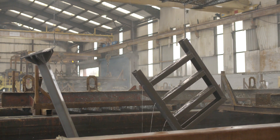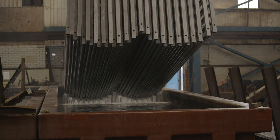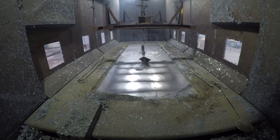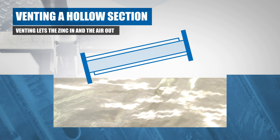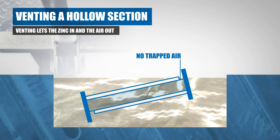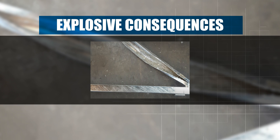Good venting and design is required to allow the fabrications to be processed effectively in our pre-galvanizing pickling baths and our galvanizing baths. This ensures that the air inside any hollow sections can escape and allow the zinc to fill. Failure to adequately vent will result in trapped air causing an explosion and endanger our personnel.